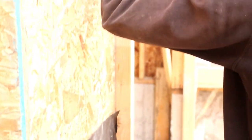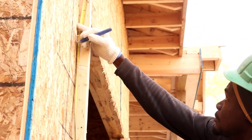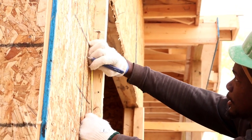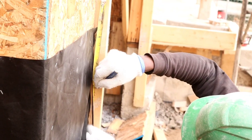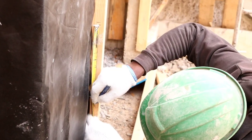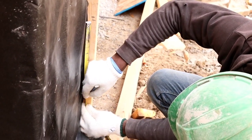We're gonna put our cut down at the bottom there, and it tells us as well the size joint that we need to work in order to get up there. So let's measure 11 1/4, start from the top. Eleven and a quarter would be here, plus our joint. And then we're gonna go with another 11 1/4, and we're gonna keep repeating the same process, right until we reach down to our foundation ledge. So basically you're gonna just go 12. 12 is good, or 11, 7, 8, somewhere there. We want to try and work for like a half an inch joint. That's a pretty reasonable joint. We're just going to keep on, go right down until we reach down to the bottom.